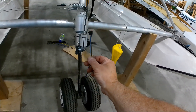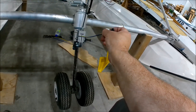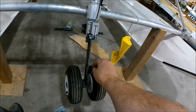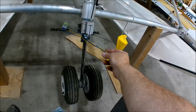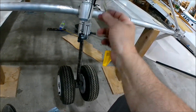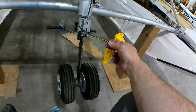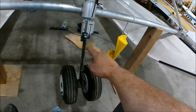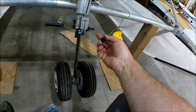It's a single pole double throw because it's going to interface with the wheel position sensor. When the wheel position is down and this is locked, it'll turn on the green light for the nose wheel. When it is up and locked, it'll turn on the blue light. But when this becomes unlocked, it turns red until it relocks again — then depending on whether the wheel is up or down, it will give you the green or the blue. I hope that makes sense.